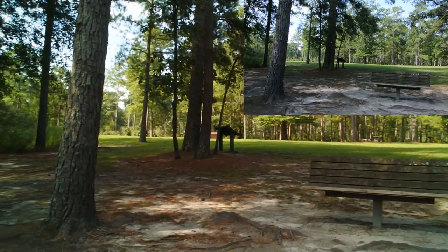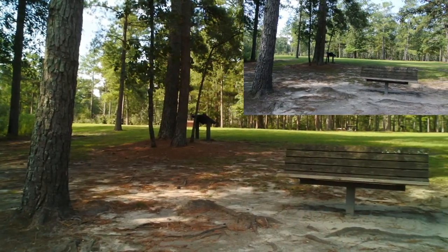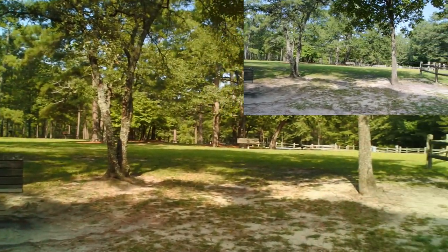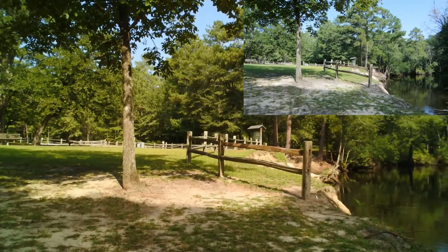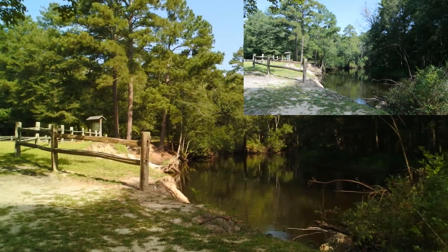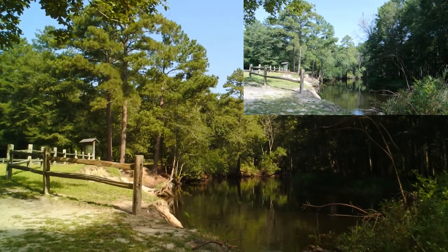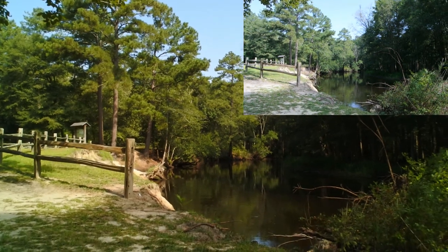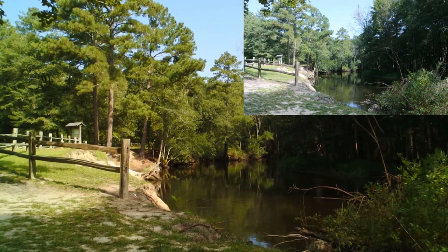So for that purpose, IR UV cuts are good, but they're not going to replicate the original filter that's on there, because it's a very specific piece of glass for a specific sensor, camera model, processing engine, the whole nine yards. And any filter manufacturer is just doing their generic brand, and depending on the brand you get, it could be very different results too, based on their take on where they want to cut off on your IR and UV, and how well their coatings are, how effective they are at blocking unwanted light. So there you have it, IR UV custom white balance on a full spectrum camera.